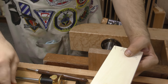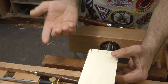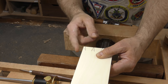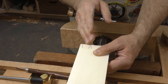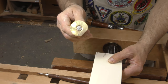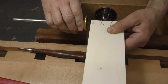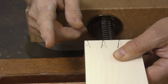That always bothered me. I came up with this idea back in 2014 or 2015: if this mark is in the wrong spot, what do you have to do to get it in the right spot? If leaving this flush means that saw kerf is going to take off part of this half pin, then what I need to do to get it in the right spot is simply move it over one saw kerf. And now that mark is in the waste, right beside this half pin. So what I do now is I measure my saw kerf, set this referencing the head of the tool — that's the brass piece — against the side of the tail pin board, put this on, and move that over until it touches. Now I have offset it effectively the thickness of one saw kerf to my left.